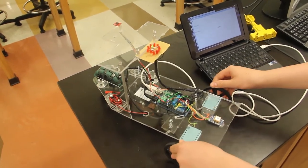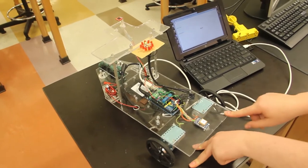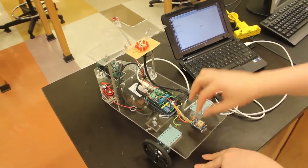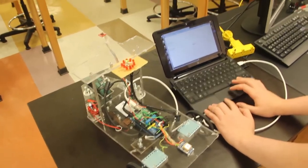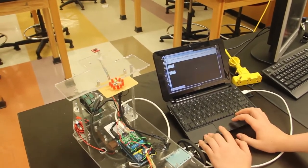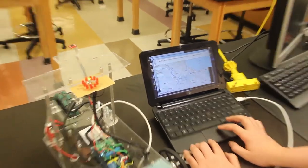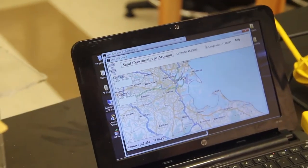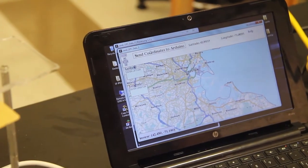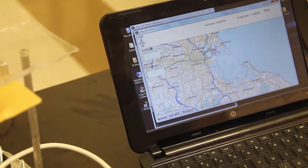The Arduino has to perform some pretty heavy calculations — some trigonometry to actually calculate a path. It does that by taking in your GPS location and then the GPS location of a target. The way I send the target location is through this Processing sketch I made. It incorporates a lot of Google Maps data, so I can type in a latitude and longitude, or just use the default one, which is Boston, and send it to the Arduino. Once the coordinates have been set, it'll drive there.